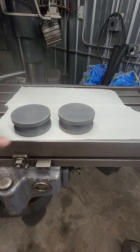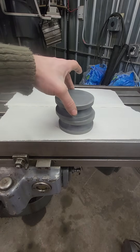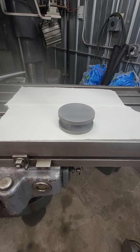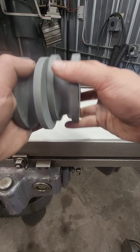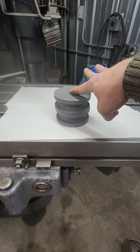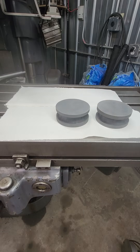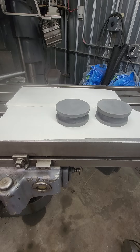The big argument about them, as I'm sure anyone watching this is aware, is that the stones are ground to a perfectly flat surface and should have essentially no friction between them. So once you've ensured they're nice and clean by your quick lap, one finger should move them around like a puck floating on an air hockey table. And you can take these on a precision ground surface, such as a mill table or lathe ways, and scrub them as hard as you want, and you won't take any metal off — it'll only remove any burrs and high spots.